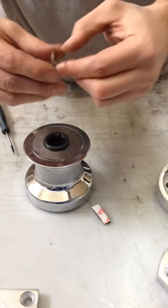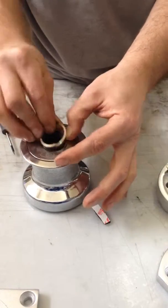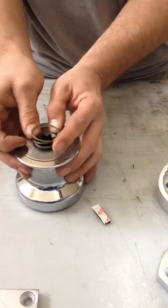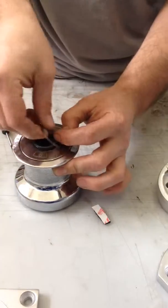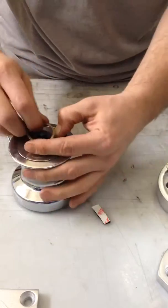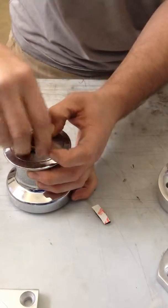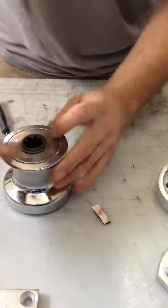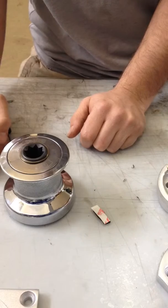Make sure they engage themselves and lock back in place. Cover back on. Retaining clip — this goes back on as such. It can be a little tricky sometimes. Just put the tail in the slot and work your way around as such. And that is how you install and remove a 6.8 to 1 winch on your davit.